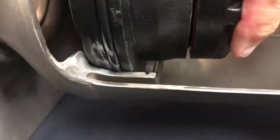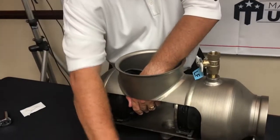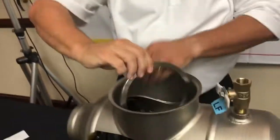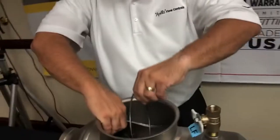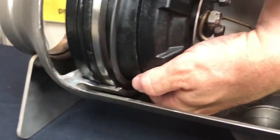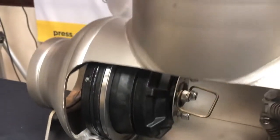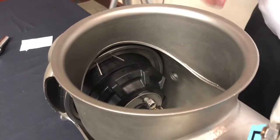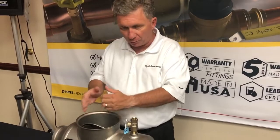Once you have that and it is fully seated, you need to make sure that's the case. You grab the outside of the backflow and push with your hand — no need to use a board or any other leverage device, as you may do damage to the unit. Then you take the stainless steel back ring, place that in so it's seated. Hold it with your right hand, then with your left hand reach all the way down into the groove at the bottom and clip it in. Make sure the clip is in place, then rotate the ears to make sure it's fully in place.